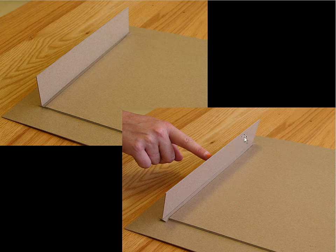So this could be a hollow core concrete masonry wall. This would be a little strip footing across the base, which is all that needs to resist gravity. But when you push on it like this, it keels over really easily. And to give you an idea of how important this is, the most common cause of death on construction sites are people crushed under walls, masonry walls or other kinds of walls, which have not been braced properly during the construction process.